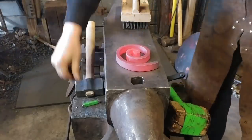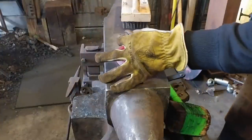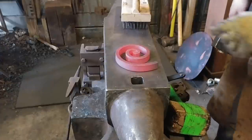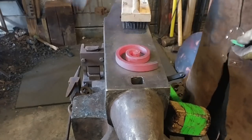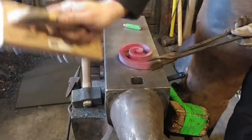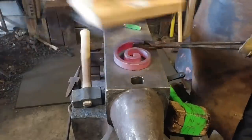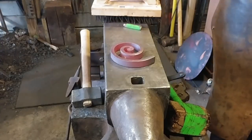The last part here, we're just going to go ahead and get ourselves a touch mark. I stamped it right there in the center piece — you can stamp it wherever you like; it just seemed convenient at the time. Be careful of that as it will draw the eye to the center of your piece. That's how all scrolls work. Give her one final brushing and then coat with whatever you like.